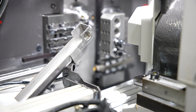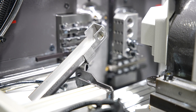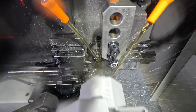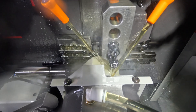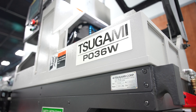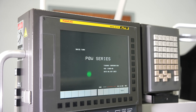Parts are ejected from the subspindle into a pneumatic chute and into a very fine mesh basket. Alternatively, a different ejector system can be used to catch the part without using the subspindle. The machine also has an option for a vacuum extraction system, which uses a tube to suck the part out and softly drop it into a basket outside of the machine. Tsugami's innovative design provides a compact, stable platform weighing nearly 2,500 pounds, optimized for precision in micromachining.